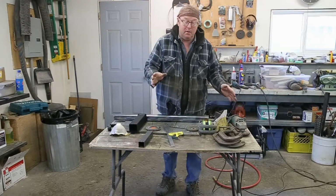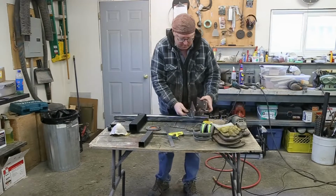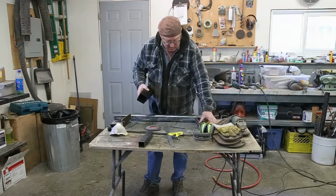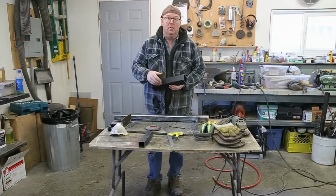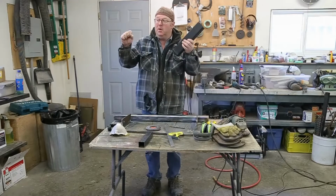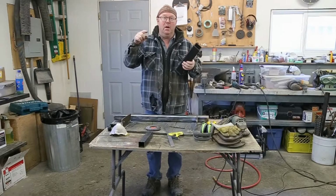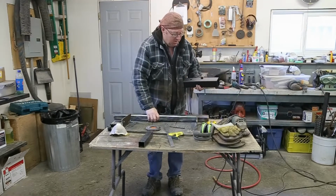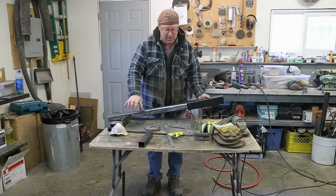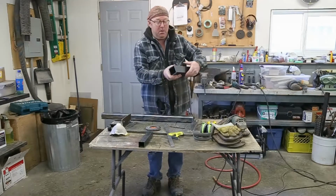So here's my thinking. I have my brackets here. Let's pretend that that's them. They go on the inside of the rails, or the inside of my frame. But what that means is that you just can't build something and just work it in there. Your frame comes in here like this, so you have to design it so that your tube can slide in just a little bit further so that you can squeeze it together and then slide it apart, and then we'll bolt this onto here.